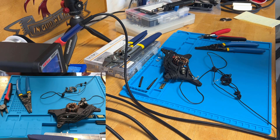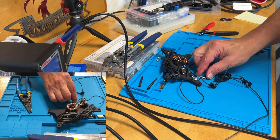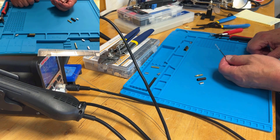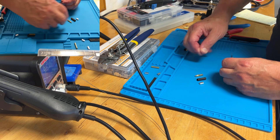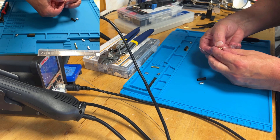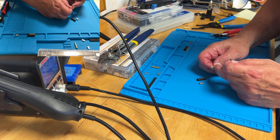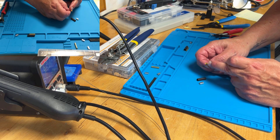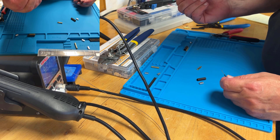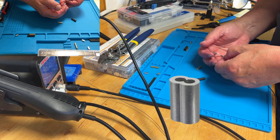Let's go through that process. First up, let's get rid of this temporary connector that was necessary to tune. I placed everything on the soldering mat and I've actually thought about doing a little bit of a change because the well in these banana clips is not as deep as I would like it to be, but it does have a hole on the outside. So I'm going to attempt to weave my wire in through the well that's going to receive the solder out the side. I think that will end up with a better joint. So the first thing I'm going to do is weave my crimping loop sleeve through.